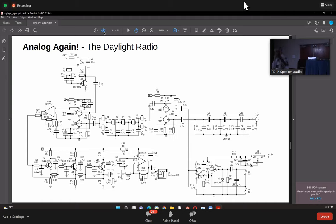Hans pointed out to me that he does not use LM386s, et cetera, in his radios. He just uses op amps, and they actually give very good audio. I thought that's because he was using direct conversion. It's not about direct conversion. It's actually a problem with the crossover distortions of these audio power amplifier chips. Probably Class D amplifiers don't have that problem, but the easiest thing to do is drop in an NE5532 in your audio amplifier.